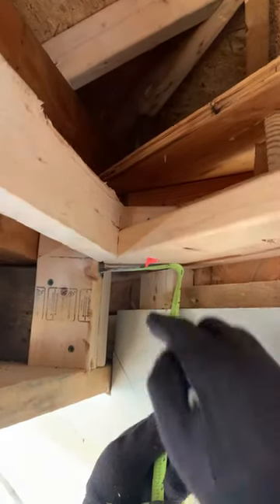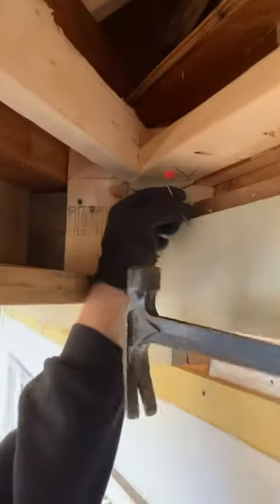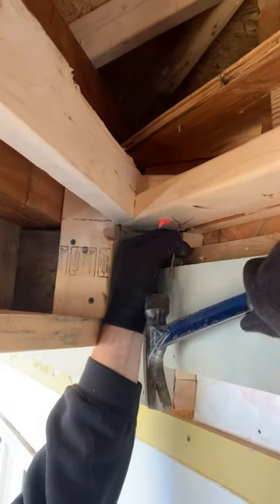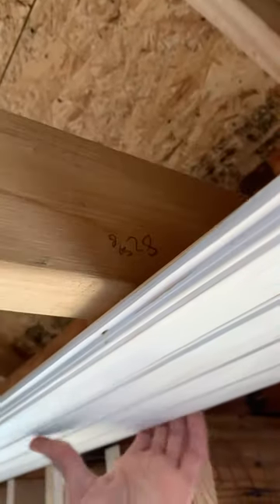I'm going to measure over four inches on each side of this header, then we're going to chalk a line and install our first piece. I don't have to be right up against the header because I've got some crown molding and some furring to do on it — make it a little wider. I'm just using narrow crown staples in the tongue, just like hardwood, upside down though.